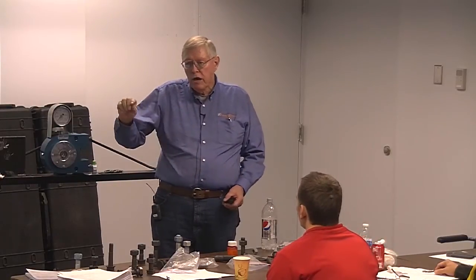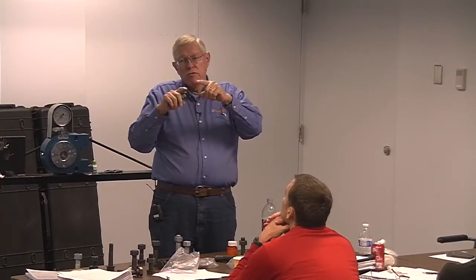If you roll a plate down to a 1/2 inch, you get it almost as smooth as this table, but a thicker plate, until you roll it down thinner, you don't get that smoothness. The thinner the plate gets, the smoother the plate is during the rolling process. These dips and bumps are allowed in the thicker plates. So then you bolt them up and you have gaps. If you have a 3/32 out of flatness tolerance in a 5-inch plate, you put two of those dips together and you're going to have a 3/16 gap between the plates.